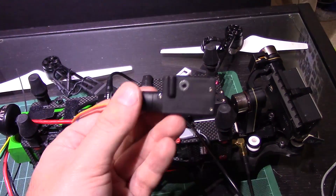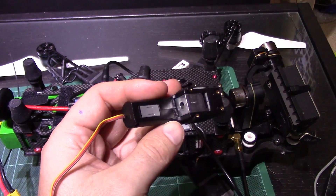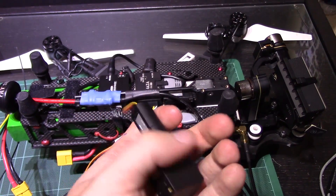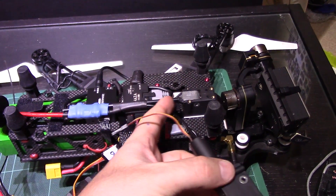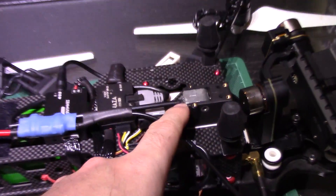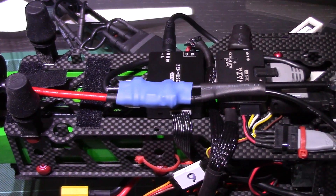As you've probably guessed, all this is is a standard retract servo. So I've got a retractable video transmitter aerial. All you need to do is buy one of these — about £4.50, they weigh about 45 grams from Hobby King — then you just need to know the shaft size, which is listed in the advert. This one is a 4mm shaft. To swap it out, undo the two hex bolts, pull it out, find some carbon, fibreglass, or wooden rod of the same diameter, shove it in, tighten the bolts, and add a dab of hot glue at the end to make sure you don't lose it. Behind the heat shrink there are a couple of cable ties securing the rod and the SMA connector.